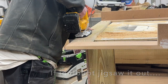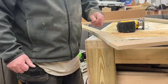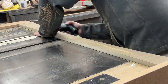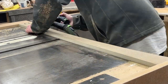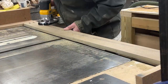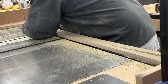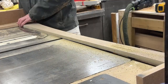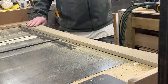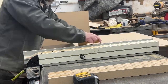I eventually gave up and went back to the old tried and tested jigsaw — drew out the pattern, cut it with the jigsaw, then sanded it flat afterwards, and it worked out fine. Not quite as smooth as a router pass but the sander soon made short work of those blade marks in the MDF. In these pictures I'm using a mixture of MDF types — the green stuff is MR, moisture resistant, and the normal brown-beige is standard MDF. It's all being painted so you'll never notice a difference.